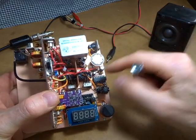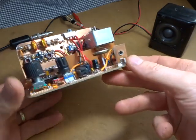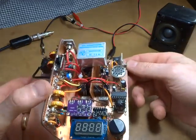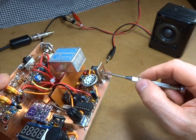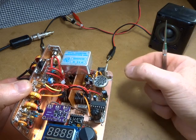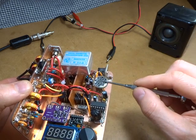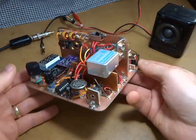The AF amplifier over here is all in place. I've got that little external speaker with a miniature speaker in place — that's just going to be mounted there nice and firm. And then the headphone socket there — I've just utilized a little switching arrangement so that with the socket out the speaker's in place, but put the headphones in and it cuts off the speaker and turns on the headphones.